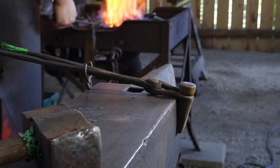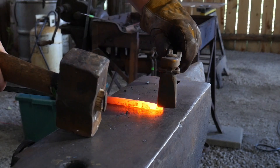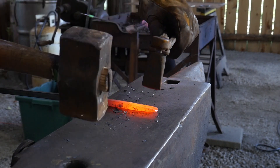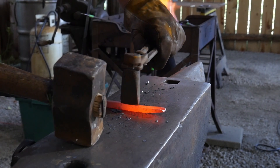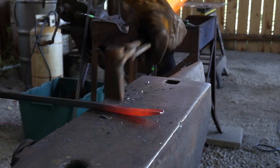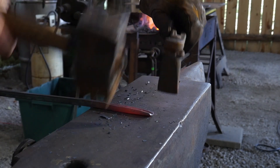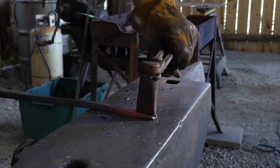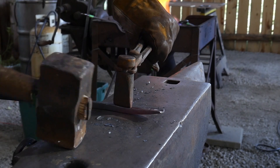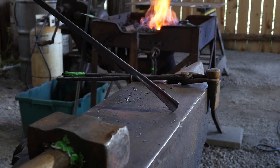We first get this set up while it is cold. Now that it's all set up and we get it back where it's nice and hot, in we go again with a little bit heavier hammer blows and we will continue to work this out. Back along the length of the bar stock I will basically hammer the fuller in to a depth that seems reasonable or has a good enough impression. Out at the end of the fishtail itself I will work the fuller to the left and the right a little bit — tilting slightly, pushing that material to both the left and the right. You can get material to move just like using the cross peen or straight peen of a hammer by directing your hammer blows and directing that fuller to do the work.